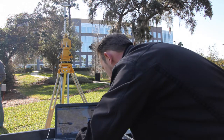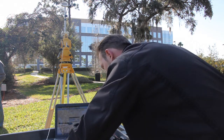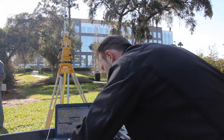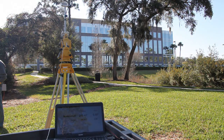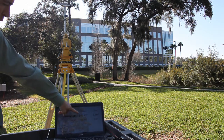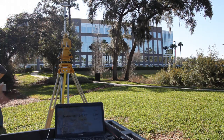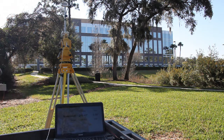So what's happening as we go from target to target, the WOM by itself relies on gyroscopes to understand how far we've moved. Gyroscopes have a cumulative error in those situations, and that's the reason why the WOM error is growing per target. So the actual that we're getting from the system is 245.4, still more than a 2 times margin for the error that we're allowed. 0.5 degree pitch, and the actual is 245.